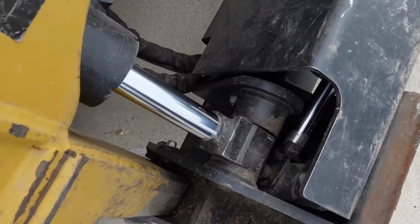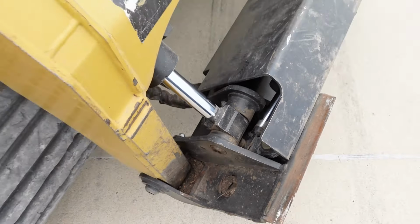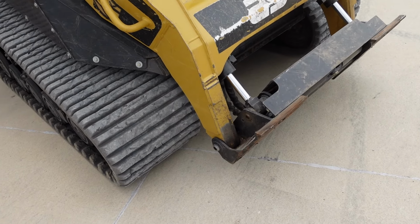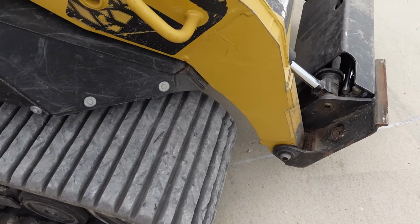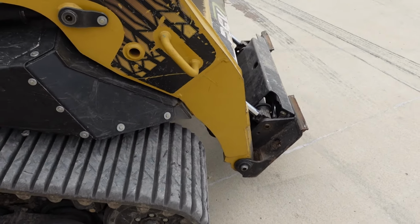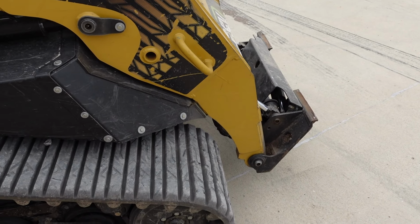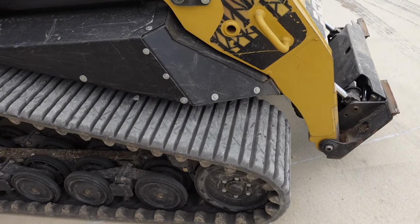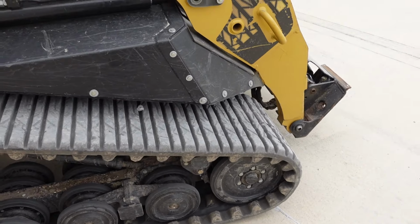You got to make sure you keep the spring assembly greased. Since I mentioned earlier, it's not hydraulically driven, it's a cylinder that pushes on a bar, and the bar has a spring that pushes on the pin. So it does have to be greased and freely moving, but I haven't had problems with attachments not coming off anymore. I've had problems with the pin sticking because I had to power wash it and re-grease it, but at least it's a simple fix.